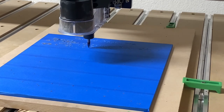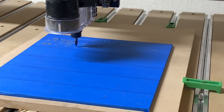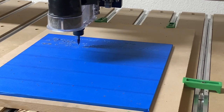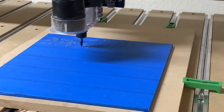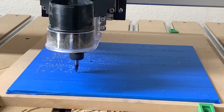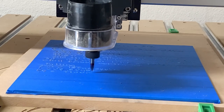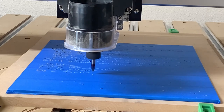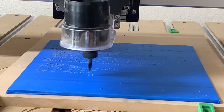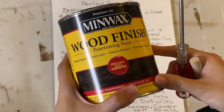When the white paint had fully cured, I applied a few coats of polyacrylic to seal the entire piece and let that cure. Then I took it over to my Shapeoko 4 XXL and got started. I masked the entire piece with blue painter's tape thinking it would reduce tearout and make staining easier, but it was just a huge hassle to peel off, so I'd definitely skip that step next time. I also taped my stock to a piece of MDF using double-sided carpet tape, then used clamps to hold down the MDF — because the recipe carved close to the edges and I didn't want to cut into my clamps.